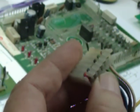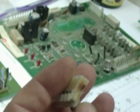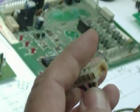And that's even with a Molex connector and not an insulation displacement connector. 6 months at the outside. If you don't play your game a lot, you'll get about 6 months. On average, you're going to get 3 months before it's trash again. And then your connection's bad, your voltage is off.